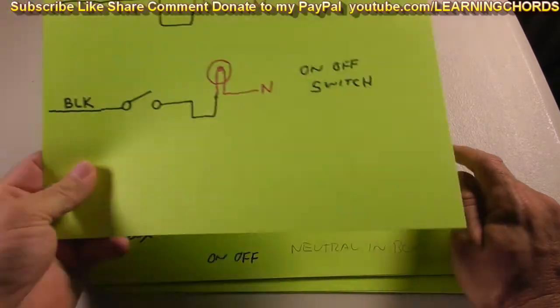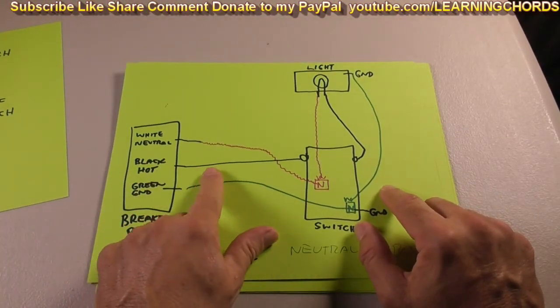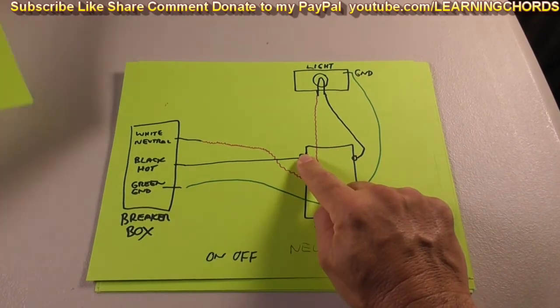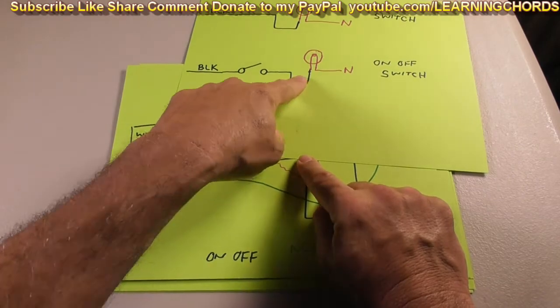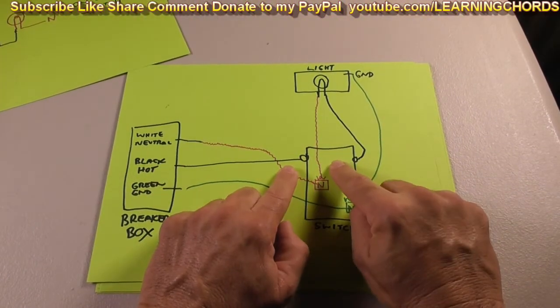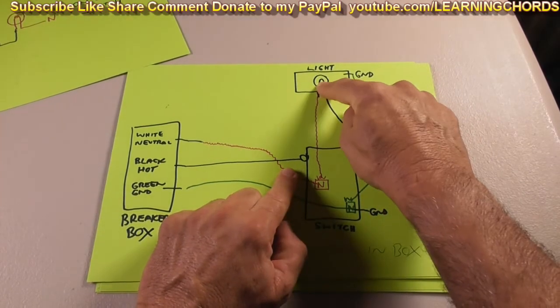We're dealing with the same thing that we had over here with the switch. We have the black coming into the box, going into the switch over here. We have the black going in and the black coming out. So the black goes into the one screw on the switch, the black goes out of the screw on the other side of the switch, and it goes to the light.